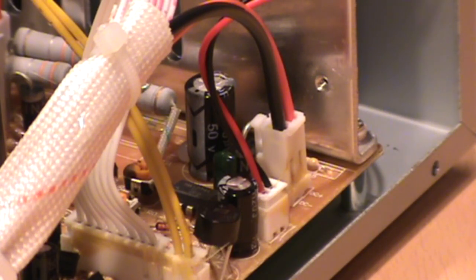Upon research on another model, I was able to identify that the other part, which is missing, is a thermistor. It's actually set for 45 degrees Celsius and will close when it hits that temperature. I am assuming that is the temperature control circuit mechanism for the fan, because other models that do contain this do not run the fan unless it's absolutely necessary.